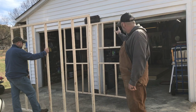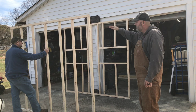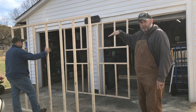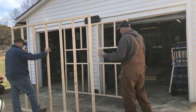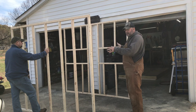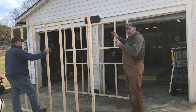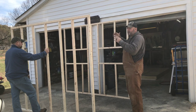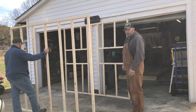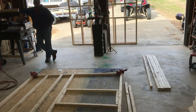I got the front wall and the back wall — I made the front wall taller and the back wall about six inches shorter so the roof will have a lean to it. Now I've got to figure out the angle I'll need when I go to build the side walls. I'm going to mock them up, hold the other piece from the top, come down, and find the angle I need to cut for the drop, then get to putting the side walls together.